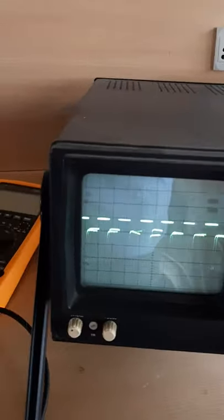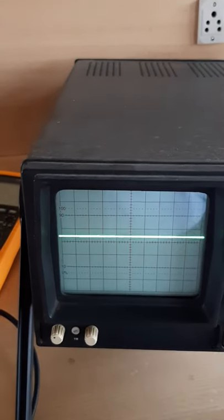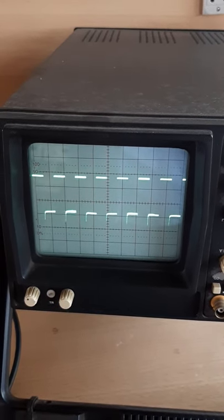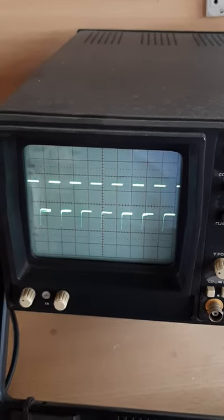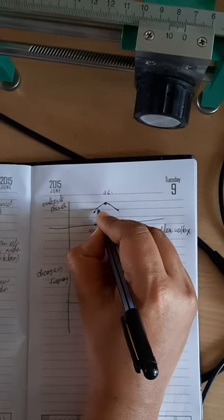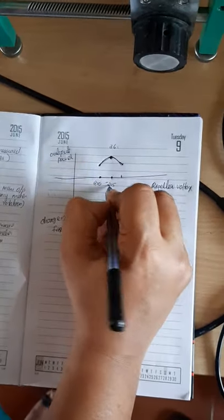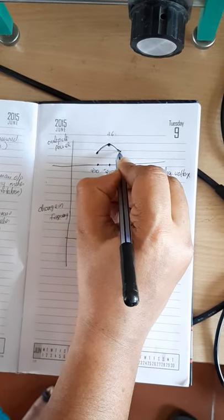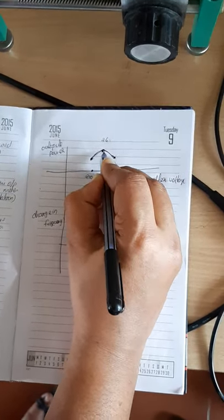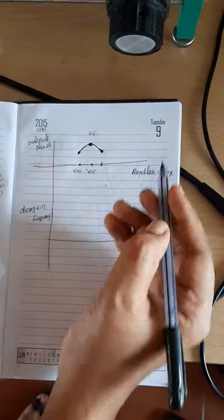the previous one. And again, I am varying the repeller voltage beyond this 250, so that I will get another point here. When we join these output points, we will get a curve like this. You can see that the output voltage is high at this minus 250, and the voltage at this point is lesser than this value. If you take another value at this point, this will be another point, and its amplitude is lesser than this maximum one. So you will get it like this.